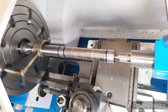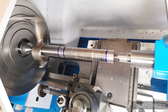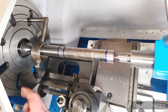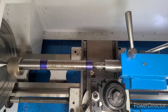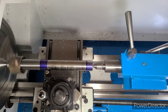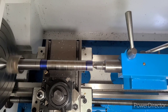What I'm worried about is the lathe dog putting everything a little off center with its weight — you can see the whole unit kind of shakes. We're going to have to figure out some way to offset that weight. Eventually I was able to re-balance the lathe just by using a bolt, some washers, and a nut. Now we're going to repeat the same process as before: apply layout fluid, use the auto feed to turn down those collars until all the fluid is gone, then measure the outside diameter of both collars with our micrometer.